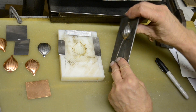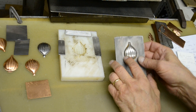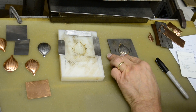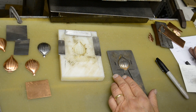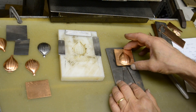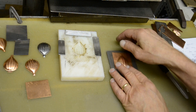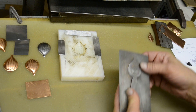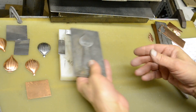Things can get kind of funky when you go deeper into a three-dimensional shape. So I decided to approach this as a two-step process where we will first form the shell over this with a urethane pad, and then load that into the die where it will then get cut and pressed a little bit more to get more detail in there.